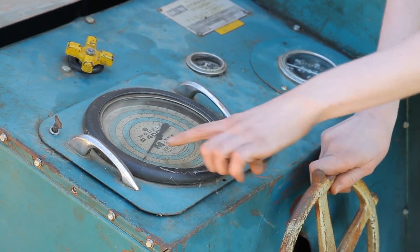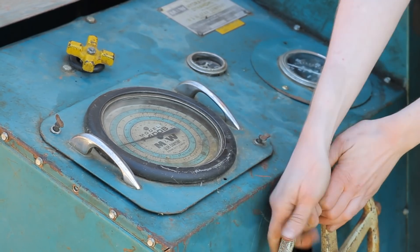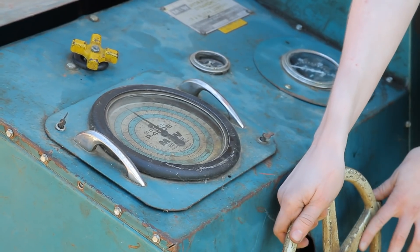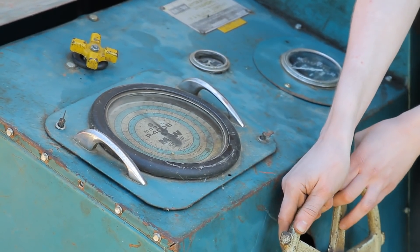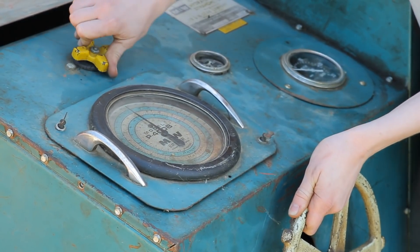So I'm watching my RPMs here and I'm watching my horsepower there. Give it a little bit more. All the way down to that 540 mark right there, and I'm gonna tighten this up so we can get a good reading.